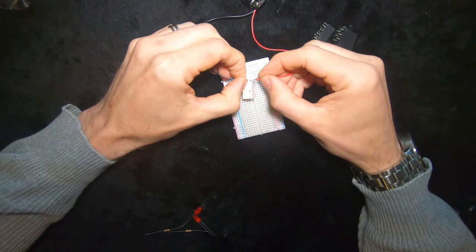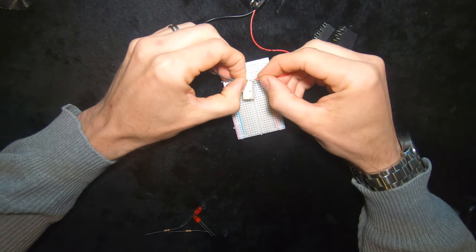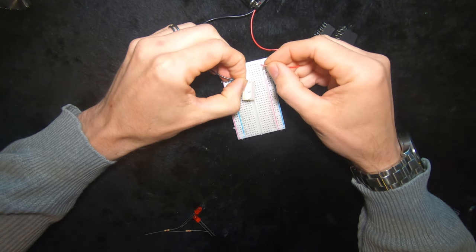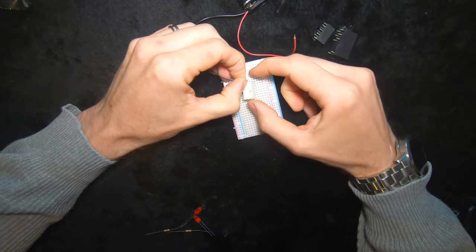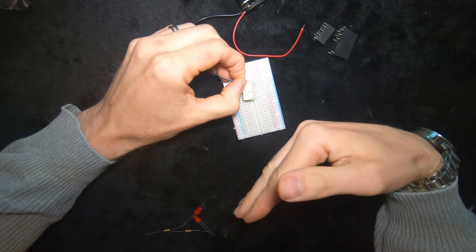As I take the wire on and off it pulls the switch towards it. You'll notice that when I pull the wire away from it — so that's on — when I pull the wire away from it, it pulls it back so it's spring-loaded. So when the power's there the switch is on, when the power's not there the switch is off.